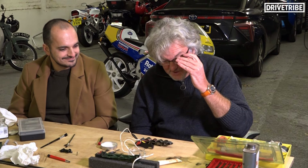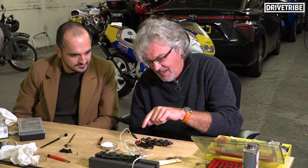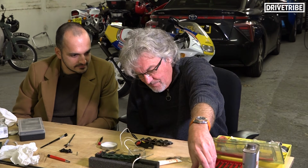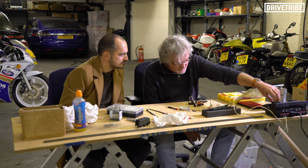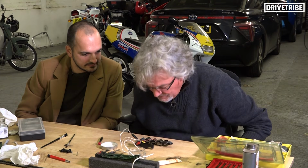Right, you join us at a very exciting moment in Can James mend Mike's train that his dad gave him in 1970. Well, it's been in the attic since the 1960s. Yep. We've rebuilt the motor, cleaned the commutator, cleaned the ends of the brushes, cleaned out all the motor housing, checked the magnet, wired it up. Here we go. That is a result. Are we agreed? Sounds nice and consistent. So the motor works. That is good.